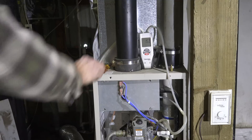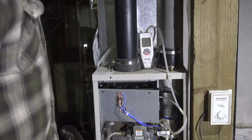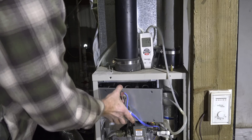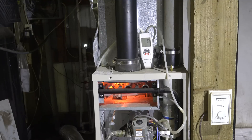If I take this cover off, we're up to high enough pressure to start. Let's wait for this thing to fire off — or at least for the hot surface igniter to come on. It's going to fire now, and that's because I took that cover off.